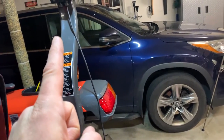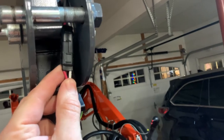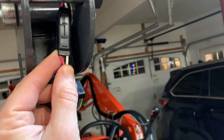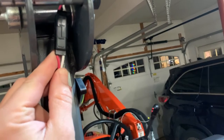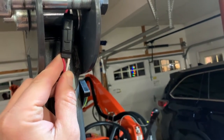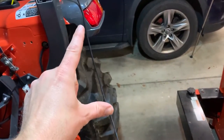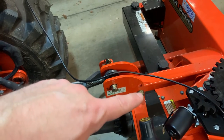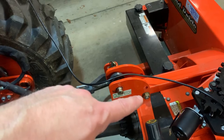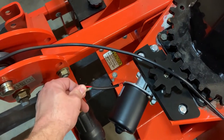For the tractor power connection I may use a standard SAE-style coupler so I can easily plug other things in — a maintenance charger, a 12-volt accessory socket, or an air compressor. I'm definitely using a Dean's-style connector on the wire run so if it gets caught it can pull apart. I'm going to start cutting my wire lengths and take this down to my electronics workbench where it's easier to solder, since the motor end will be hard-connected.